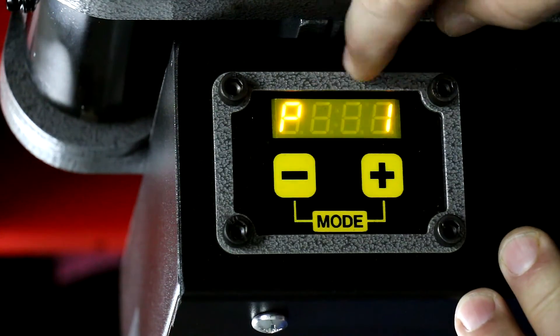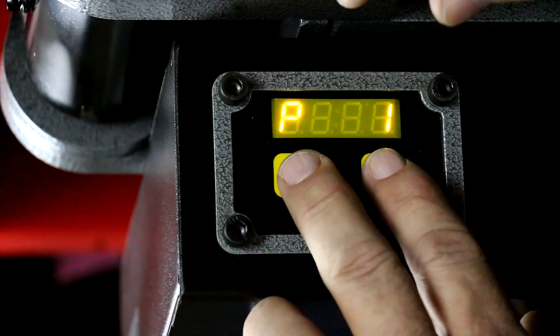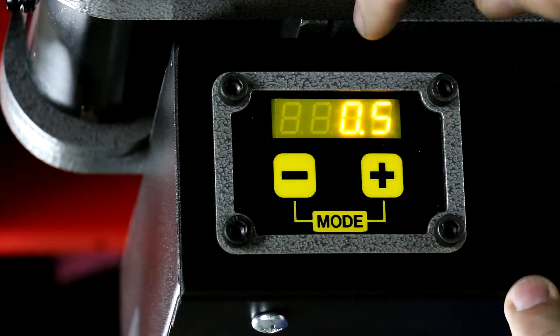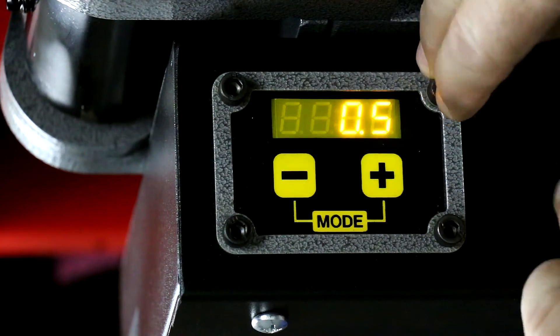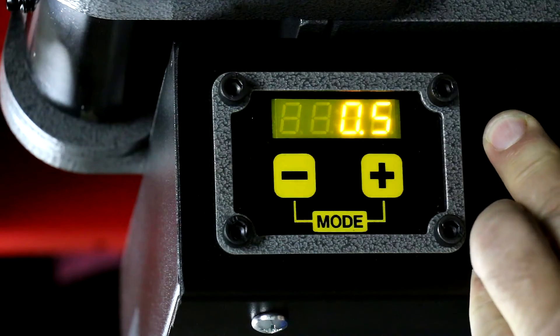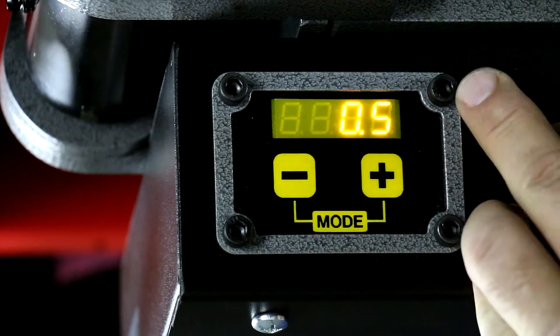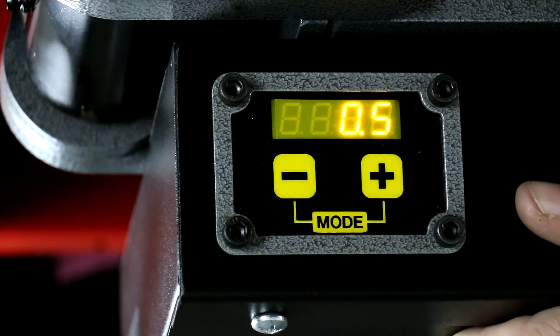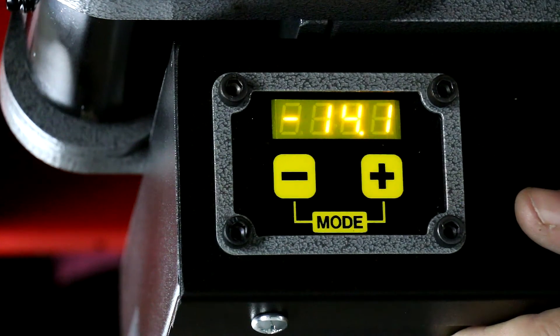We've selected what is set for 98 degrees. If we hit both buttons simultaneously, we change up to the operational mode. This mode lets us accomplish two tasks. One, we can actually read the degree of rotation of the spindle — right now it's saying it's at 0.5 degrees. If I reach forward and manually rotate the die, you can see the digits going up in tenth-degree increments.